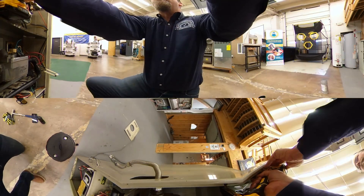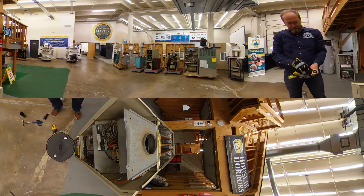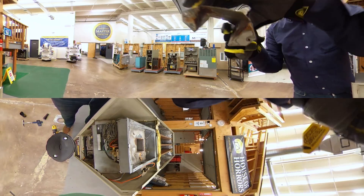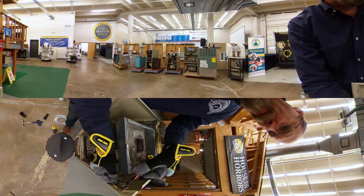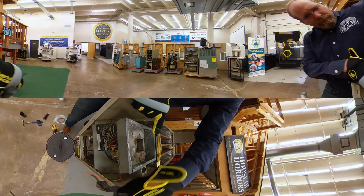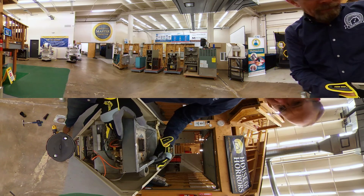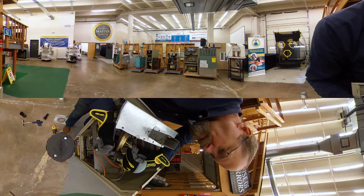I want to pull it apart, but it looks like things are more together than I thought. Let's take some more components off and get my gloves on because we're going to tear apart some metal. The exhaust gases go past a hood to control the direction. There's another safety switch just in case the exhaust gas temperature is really high — if it's too high, it'll shut it off. The exhaust gases go in that hole on the side of the exhaust box. It's connected to the top of the draft inducer fan, and there's another switch that senses pressure — we want a draft. There's the fan with the fan motor.